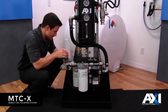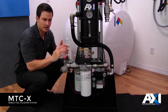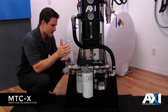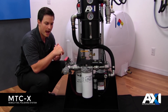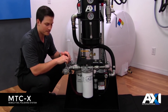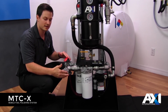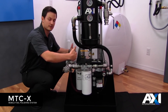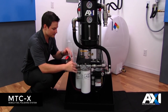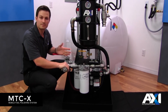During that process you can see the clear hose behind the filter bank turn the color of the fluid, and you'll see actual fuel moving through it. Wait a minute or two until the tube is majority air — when that happens, the filters are drained to an acceptable level. Turn the valve back to the off position; the system can keep running. With the diverter valve still in bypass mode, you can now remove the filters, replace them with clean ones, ensure the seal is tight, and when ready to resume fine filtration simply change the valve back into the filter bank.